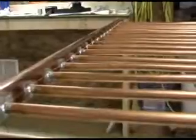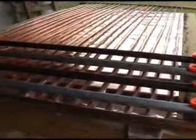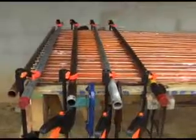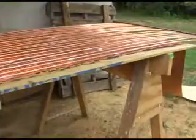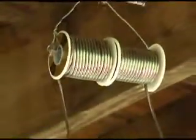Soldering headers indoors is okay, but the next step, soldering 5/1000 inch thick copper sheet to the copper tube, is best done outside due to the amount of smoke you will create. Press the copper sheet securely against the copper pipe. I found 3/4 inch black iron pipe did a reasonable job. Have lots of solder available.